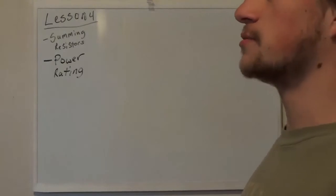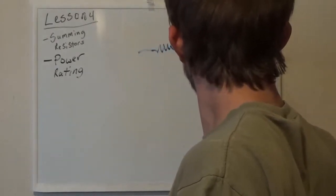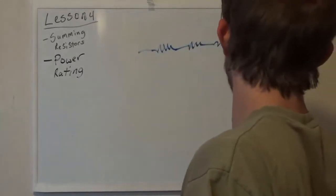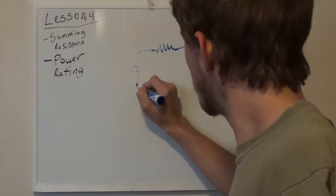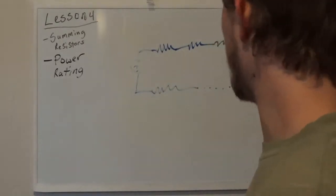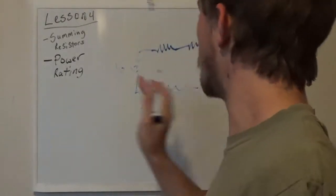So we're talking about what voltage and current do. How does resistance work? Let's say we have a network of resistors that maybe continues forever to generalize it. Eventually these resistors are going to wrap back around into the source. How do we deal with these resistances? Some of you might already know that the total equivalent resistance is going to be R1 plus R2 plus R3 plus dot dot dot R to the N. But why is it that way? Why can you use this formula?